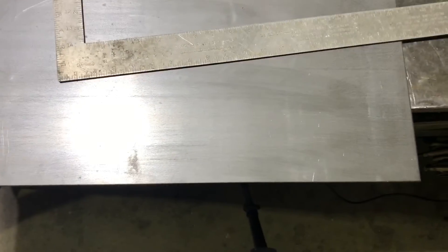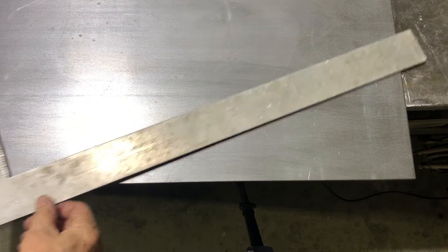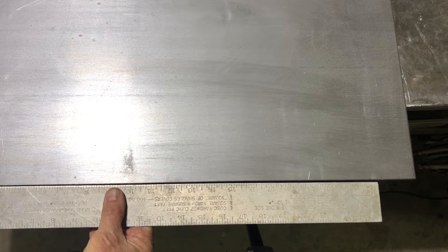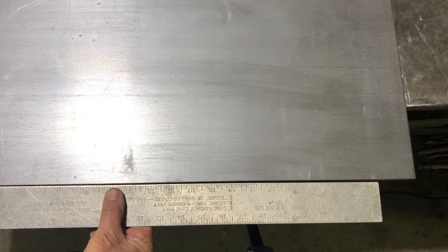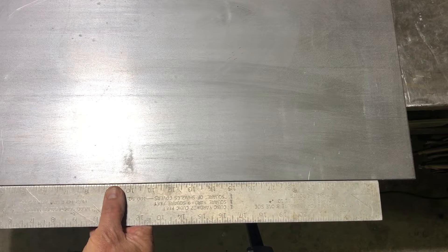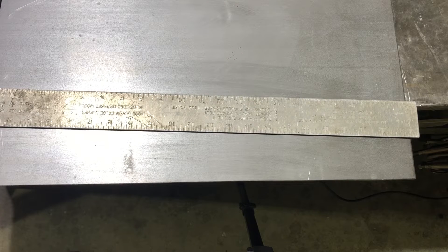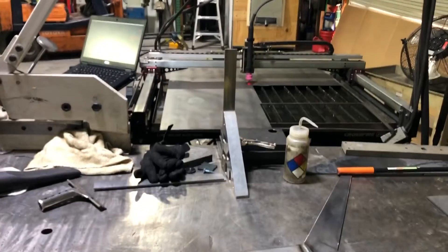I'll turn you facing down here and see if we can't measure. I've just got a square and lining it up on one side. And you can see that I am off — maybe 3/16ths of an inch on the length of this, which is about 24 inches, about 2 feet. So I would gather that my X direction is off. I wanted to see if that was confirmed and obviously try to fix it.